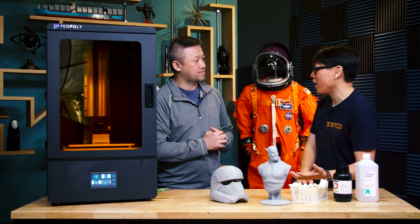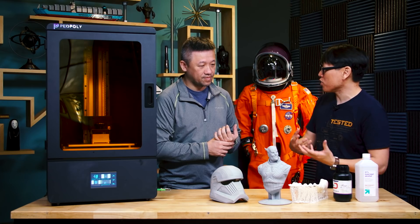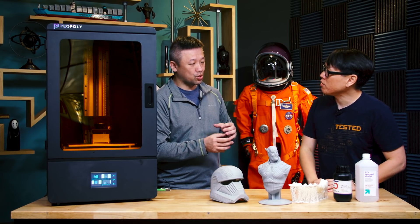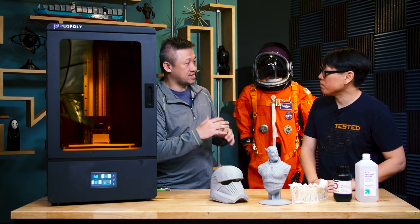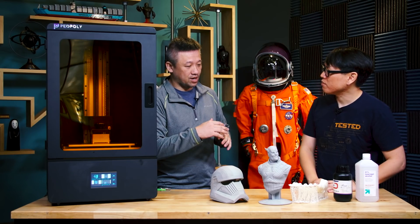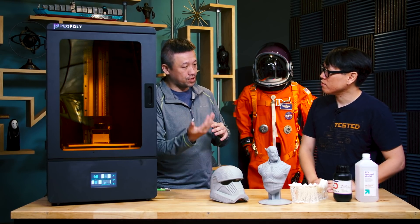You can't just find any LCD panel and put it in there. You're looking for certain qualities of LCD that make it good for capturing and passing through UV light. So what's the source of the UV light, and what do you do to make sure there's no diffusion? Underneath the LCD panel there's a large LED array that shines UV light at 405 nanometers. Because each LED is separated, the light is not as even as you would like for good printing quality.